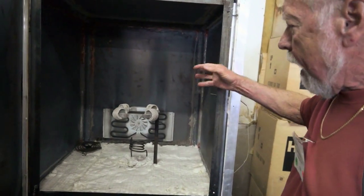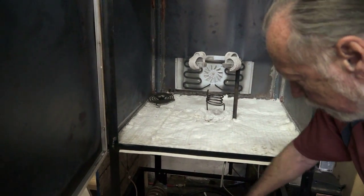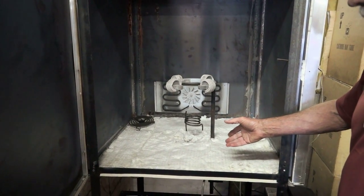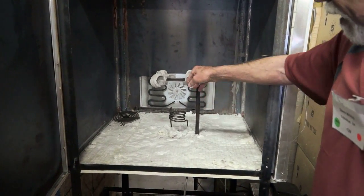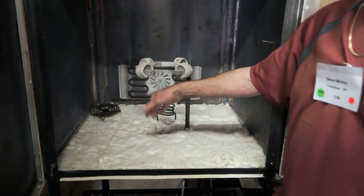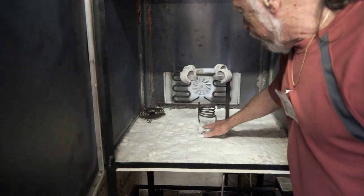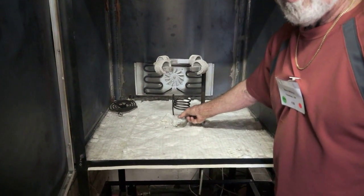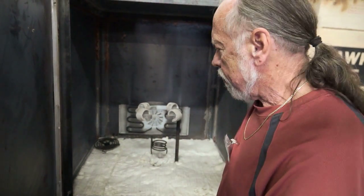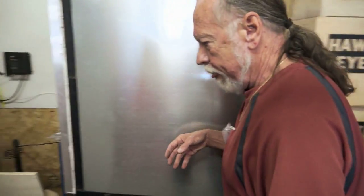Once you have all the air out, then this device is fed with an RF signal from here. And what that does is activate and heat up the gun, which gets more remaining molecules out of it. Once that's done, it's not shown, we don't have it mounted right now, but there's a thing called a tip-off coil that when you put electrical energy into it, it melts the glass closed, so it keeps the vacuum within the tube. Then the next step is over here.